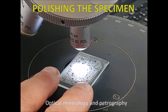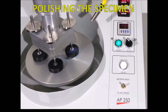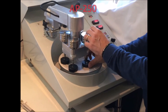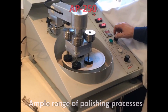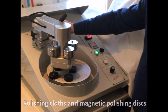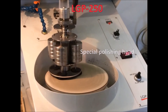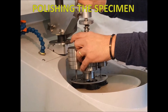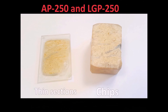In certain fields such as optical mineralogy and petrography, thin sections must be polished. Vinci offers two solutions. The AP250 automated polishing machine can be employed to flawlessly process up to 4 thin sections simultaneously. By virtue of a variable speed motor, an ample range of polishing processes can be carried out, including final polishing with oxide polishing suspensions. The device functions with both polishing cloths and magnetic polishing discs. The alternative LGP250, equipped with a special head, allows the efficient, simultaneous polishing of up to 4 thin sections. Variable weights apply a force to hold the sample's position on the disc. Unlike the AP250 model, the LGP250 accepts both thin sections as well as chips.